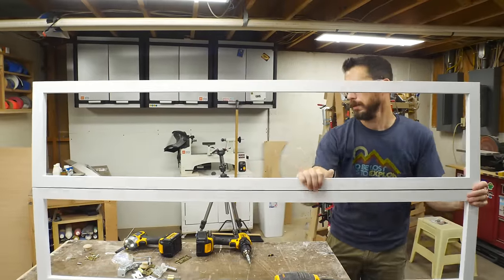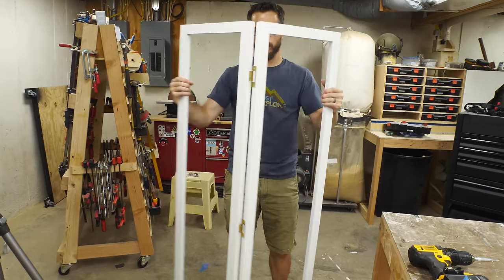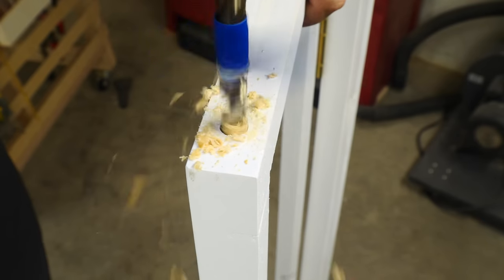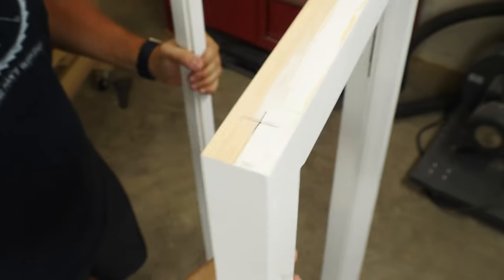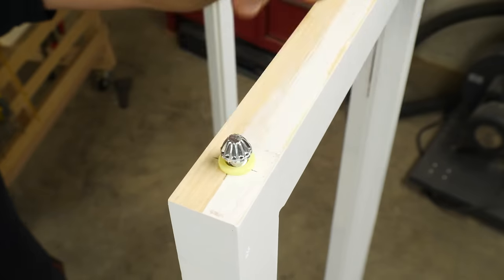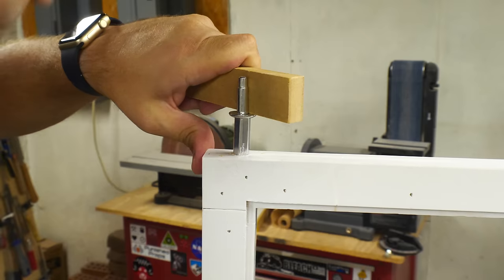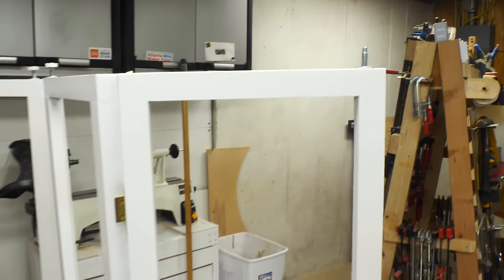These kits are really easy to put together — all the instructions are simple and straightforward, and they give you all the measurements and every piece of hardware you need. Each door has three points connected to the frame. There are two at the top that are spring-loaded — you drill a hole and knock in these spring-loaded pieces. One has a wheel to move freely in the track, and the other gets fixed in the corner. On the bottom there's a sleeve that gets knocked into place and a little foot that can screw in and out to adjust the height.